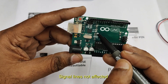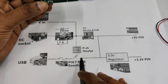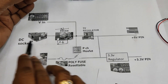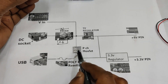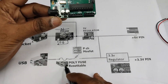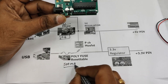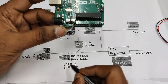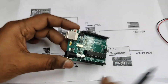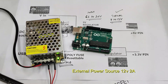By default, there is a low at the gate so the switch is closed. When you provide a USB cable, the voltage passes through the polyfuse and reaches the 5-volt pin; the 5-volt regulator does not come into picture. When you provide supply at the DC socket or Vin pin, a high voltage is at the gate of the P-channel MOSFET, so the switch opens — the USB power line is disabled, but the RX/TX signal pins are not affected. Note that this resetable polyfuse is provided only in Arduino Uno and Mega; the Nano does not have it.